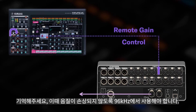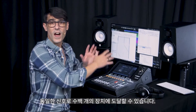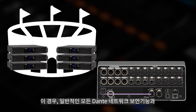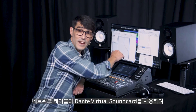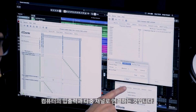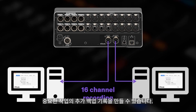Remember to use it at 96 kHz to avoid any compromise. The Dante module of DM3 is able to transmit multicast audio, reaching hundreds of devices with the same signal — such as a full sports stadium worth of amplifiers. In that case, you'll be relieved to hear it's compatible with all the usual Dante network security features. By far the most convenient use of Dante is for multi-channel connection in and out of computers using just a network cable and the Dante Virtual Sound Card. The advantage over USB is that Dante allows multiple computers to be connected, so additional backup recordings can be made of important performances.